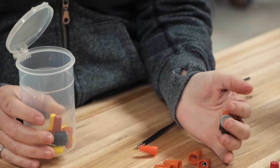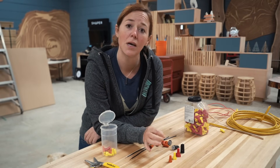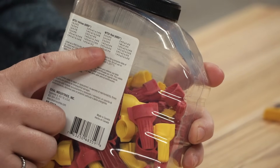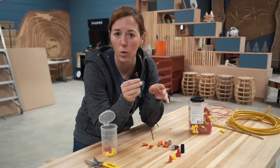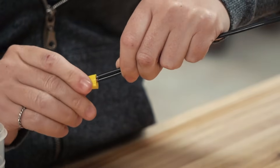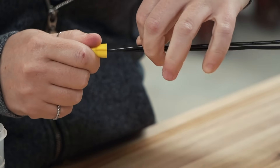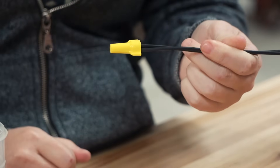For wire-to-wire connections, wire nuts are the go-to, and the coloring is an indication of the wire size and how many wires they can receive. There's always a sizing chart on the side of the container. A lot of people think you have to pre-twist wires before using a wire nut, but that's not true. Cut them to the same length, stab them in, and keep twisting until there are a few twists at the insulation. Then give each wire a tug to make sure it doesn't pop out.